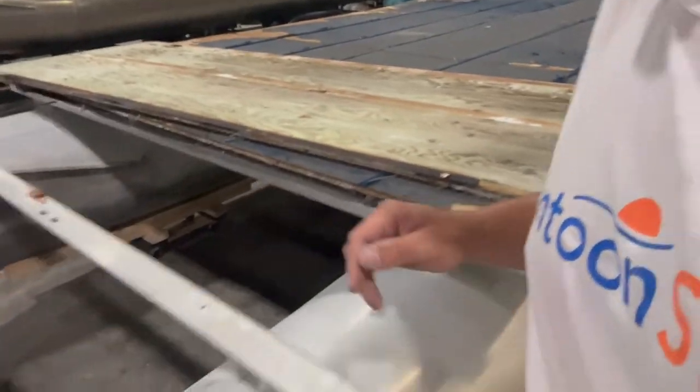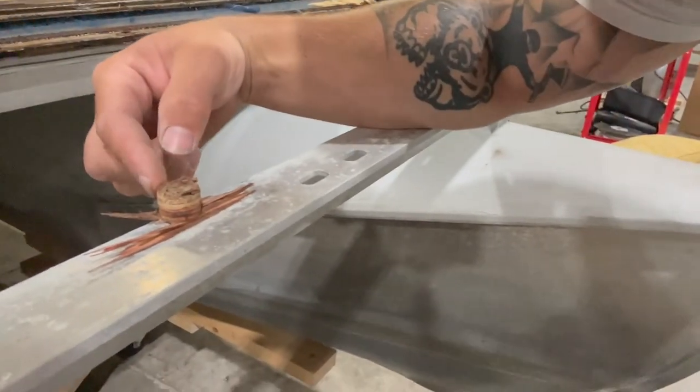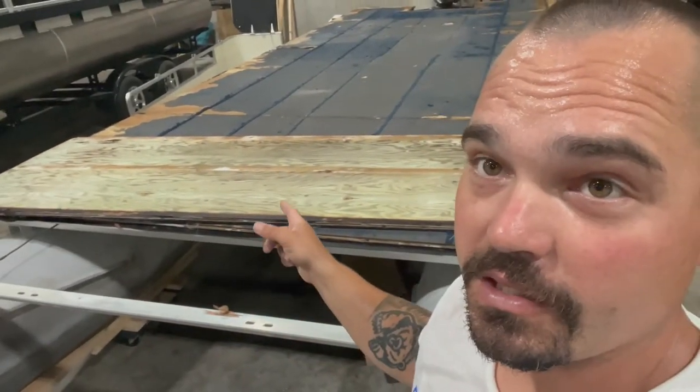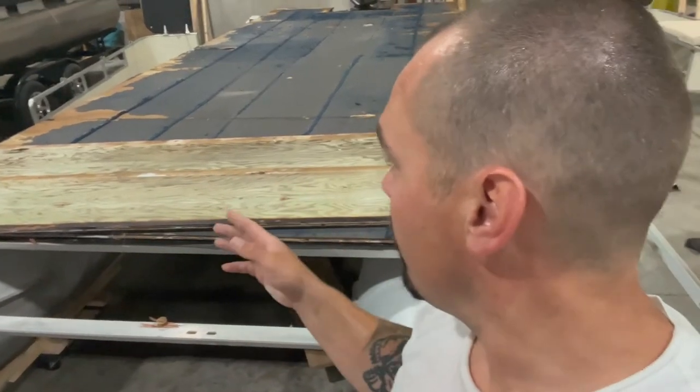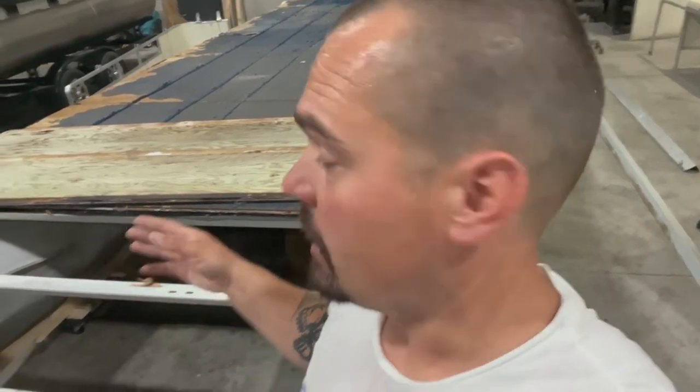I've got the screws pulled out of this first board. The hole cutting bit leaves a little plug, about three-quarter inch tall, and I can go back and take that off with my angle grinder flush to the metal before I get this board out. This was a funny dimension board — not a full 48 inches on an eight-foot-wide boat. So I'm going to make sure I measure that, because when I go to redeck this boat I'll need to run it through the table saw or use a circular saw to cut the proper length. I could also just lay it on another board and template it. There's a good chance too you're going to have some funny-shaped boards in the back, especially around the motor cutout — save those pieces, make your measurements, use them as templates. That's going to save you a ton of time when putting your new deck on.